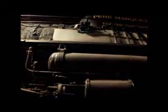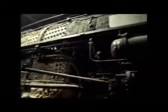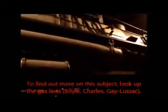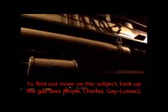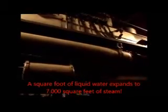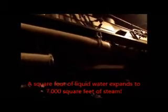But there is an exception to that rule, which is pressure, because the water in here is under pressure, meaning that there's no extra air getting inside, so it has to be heated up further, thus the fire is pretty hot, to get it to turn into steam. So most likely the water in here is about 425 degrees, usually, before it turns into steam.